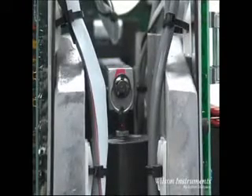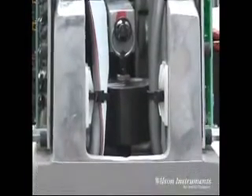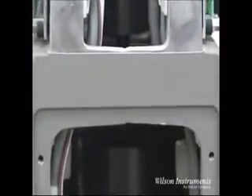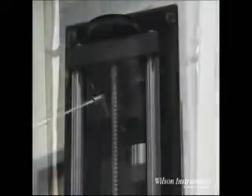At the front of the lever, the pivot point guides the downward motion which is transferred to the indenter. Deadweight systems are mechanically oriented and rely less on processes and more on user interaction. Stability of the weights is important in ensuring smooth and precise load control.